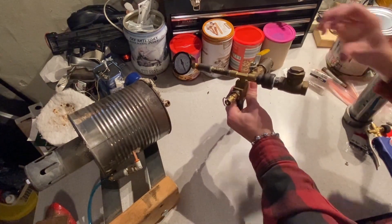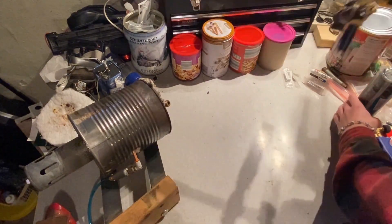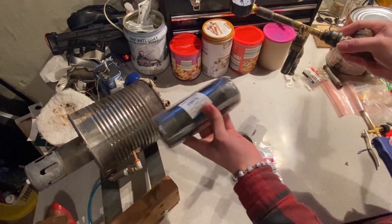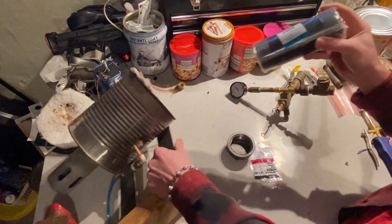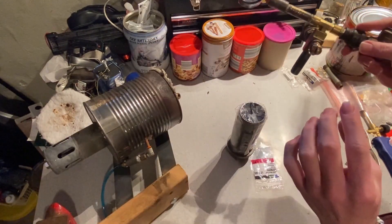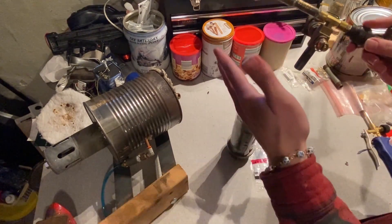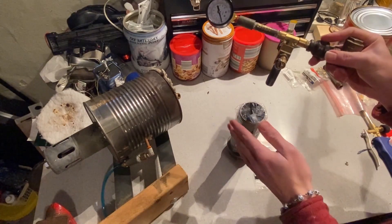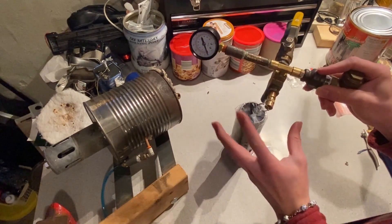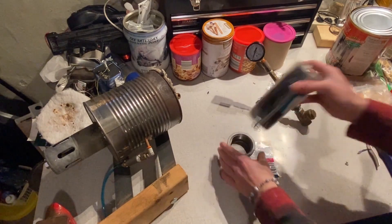The check valve will make sure nothing blows back. Next, the steam is going to come down this tube into the reservoir — a two-inch pipe about six inches long — which fits snugly inside the coil itself. The purpose of heating this reservoir is to remove excess moisture present when steam is initially created. We also have a safety relief valve, a pressure gauge to monitor the system, and everything is wrapped in felt.